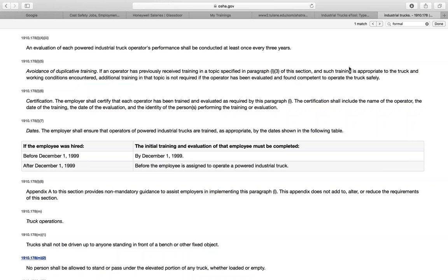And then concrete mule, folks, there you go. Before using any type of concrete mule, we have to conduct a thorough inspection of everything: tires, fluids, mechanical hinges, the joints, any type of throttle cables and steering mechanisms. We need to make sure that all those pieces of equipment and all those accessories are in an adequate and safe working condition.